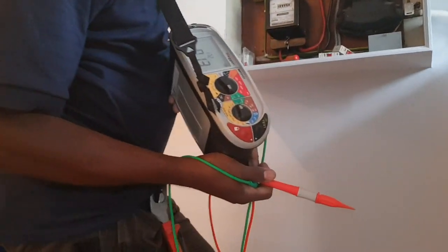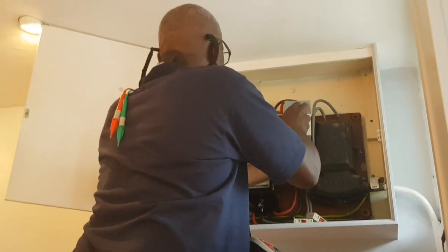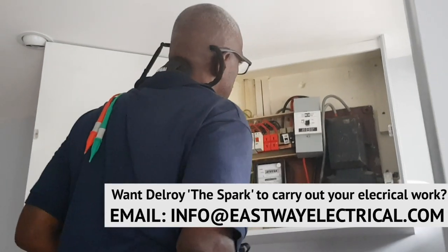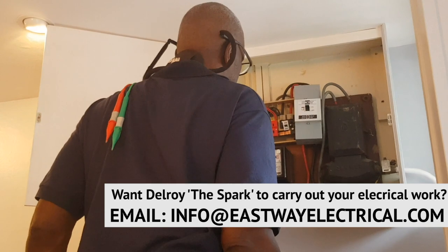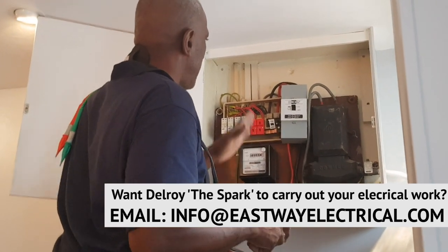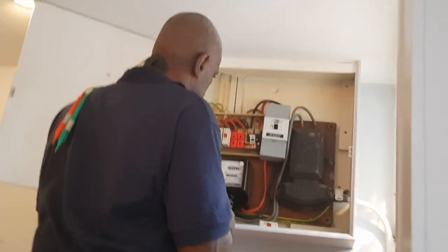1.72 — this is not clever, this is not good. I'm going to put that down as a Code 2, meaning the switch not installed correctly. I don't think that's right — you guys tell me what you think, if you think I'm right to do that. I'm not happy with that at all. It's not positioned in the right position and it's just too tight. Getting the fuse board cover off was a bit difficult because it's really on the edge of that. Not good.